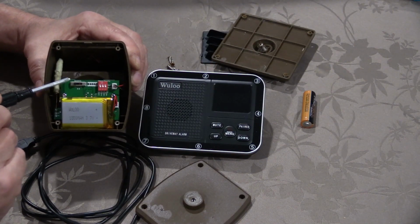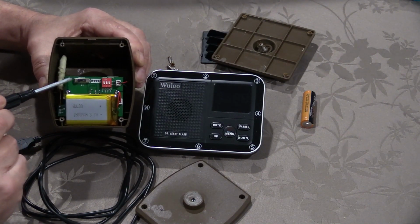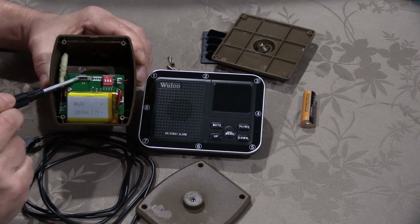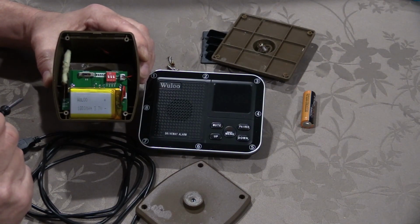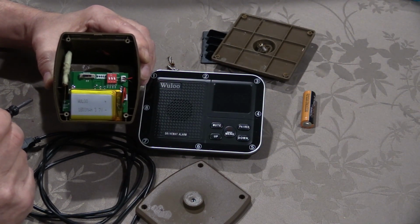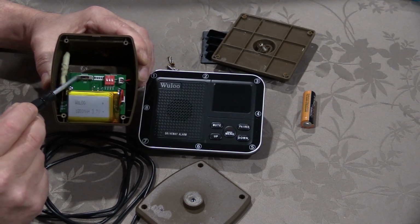This switch here is a sensitivity. It'll go from, I believe, anything within an 8 foot range, a 12 foot, and a 28-foot range, depending on the sensitivity. You may think right away, I want to put this into the 28-foot zone, but don't. It's way too sensitive. You're probably better off looking at the low sensitivity setting on here.